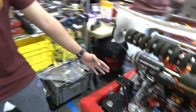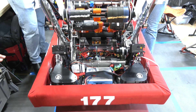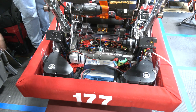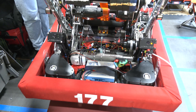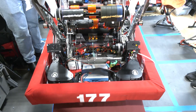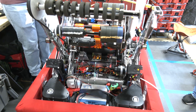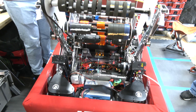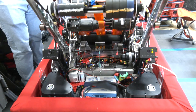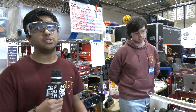The next part of our vision system is these two Limelights here, which track AprilTags. We use two for stereo vision and do pose estimation, finding the angle to the speaker AprilTag with each Limelight and averaging that from our calculated pose — giving us the holonomic angle so we can strafe while locking rotation onto the speaker. When the game came out, auto-alignment was a must-have: we needed consistent speaker shots, and because of how the speaker is designed it's hard to align consistently from various field positions, so AprilTag-based pose estimation was the only real solution.